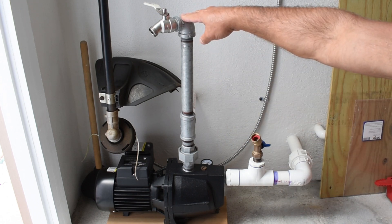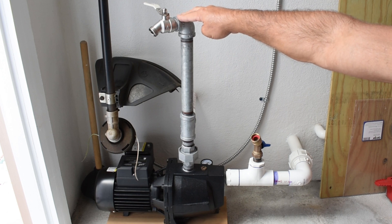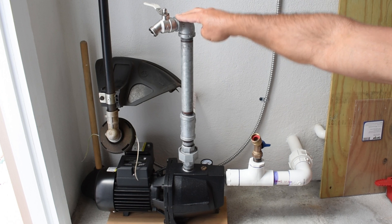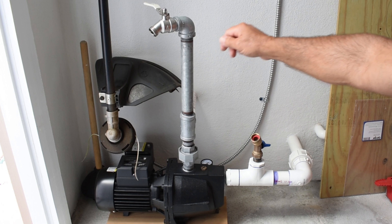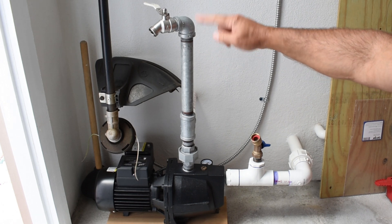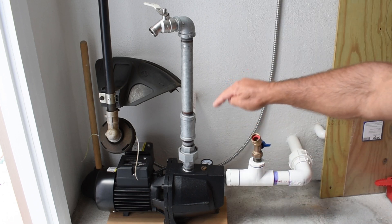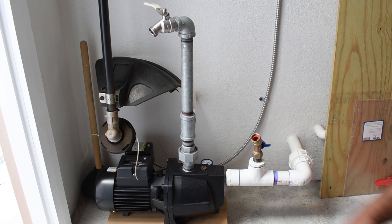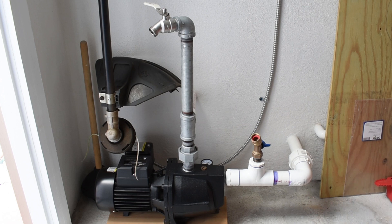When I put this pump in a couple of years ago to replace the existing one, there was a hose bib in the front and the rear. It was older piping, so I ripped it out and replaced it, but there were no sprinkler heads in the yard. Since then, I added sprinkler heads, so I need to have a timer that's going to go through the four zones. You can see the index valve right here that I installed, and that's why I need to power this 120 volt pump using a sprinkler timer that can handle the load of a one horsepower pump.